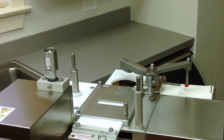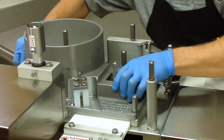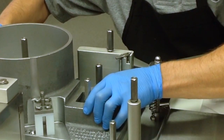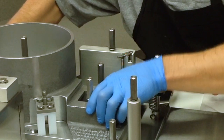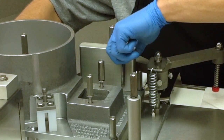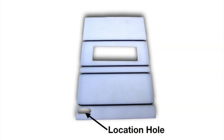Place the hopper over the shaft onto the machine and slide the slots under the hold-down bolts. Make sure the retaining rod is all the way into the double seal spacer plate by lifting it from its storage position and turning it until it slides into the double seal spacer plate's location hole.